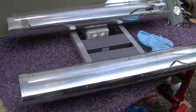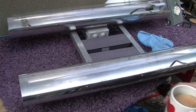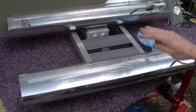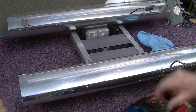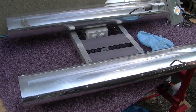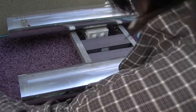A brief description of the design rationale: the issue with the previous design was that the case was far too complex to make and exceedingly expensive for how well it did the job. With this design the tubular construction did away with the need for a large-scale frame. The holders for the heat sink essentially become the structural component, and as you can see with the acrylic siliconed and screwed to the aluminium, we have an incredibly rigid body here even without the ends on.